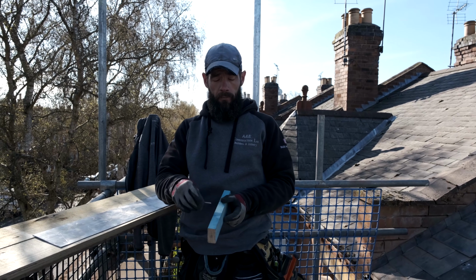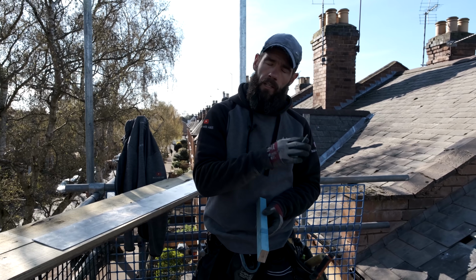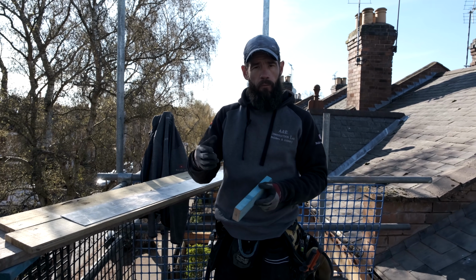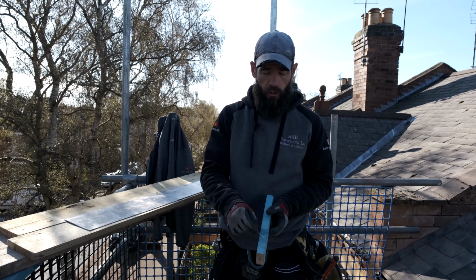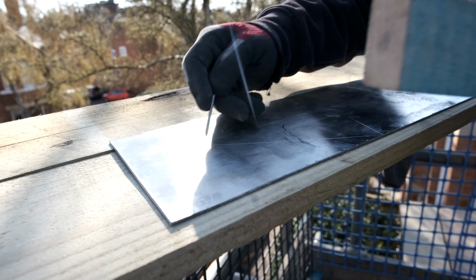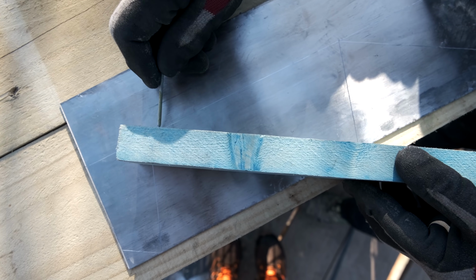Depth of your blade is going to be how far you want to go with this, because if you've got it too long, it's going to make life so much more difficult when you're trying to put it in, okay? So I know with my blade it's a little bit worn down, so it's just under an inch. If you can imagine, that's an inch as well, all right? I like to put my lath exactly right on this point. See this line? I'm going to bring that bit of lath to that line there. So that's now flush on this line.